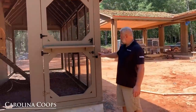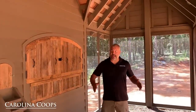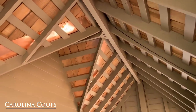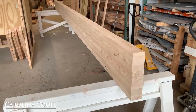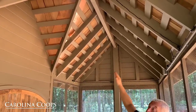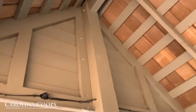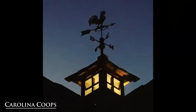Inside the run with the 12-12 pitch, we measured about 11 and a half feet from the floor all the way up to the peak. With this design we couldn't do trusses, so we used one large glulam beam running all the way across, notched into the 6x6s and carriage-bolted at the top to hold all the weight. We have rafters, purlins, and you can see the underside of that cedar along with the underside of the copper valley flashing — just looks absolutely awesome. The black wires stapled above the electrical conduit are for the soffit lighting, which looks amazing at night.